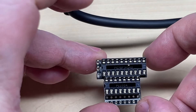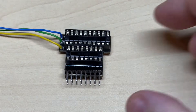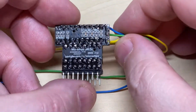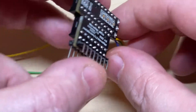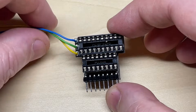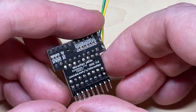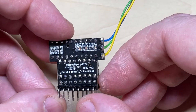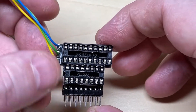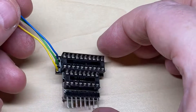It just brings three wires off. We've fitted some sockets on it because I don't want to solder directly until I've decided it's working. So there we are — it's fully constructed, there's not much to it really. Just some 2.54 right-angle pin headers, three wires, and the IC sockets. In the final design I probably won't socket the PIC, but I will socket the PLL. For this test unit it's looking pretty good.